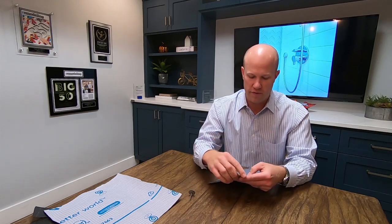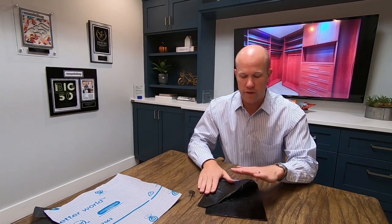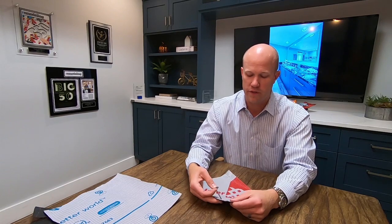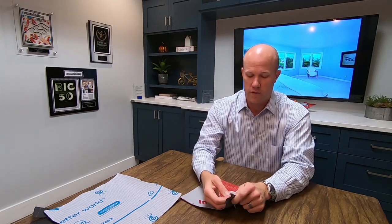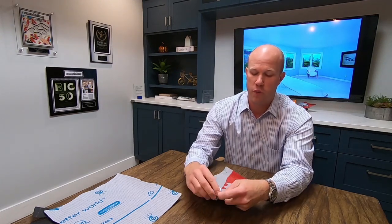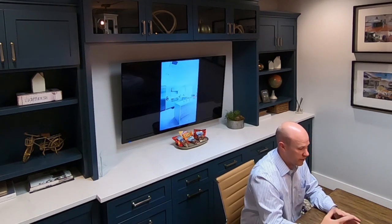We don't get much ice in San Diego, but the benefit of this is when you peel it off, it sticks to the roof structure — to the deck, the plywood or the skip sheet that you have. It's really sticky. And speaking of the nail test, when you stick a nail through this, it wraps all the way around — you can even see on the bottom it just grabs onto the nail. And when you pull it out, it really closes in on that. So even over time, it'll lock around every single nail.